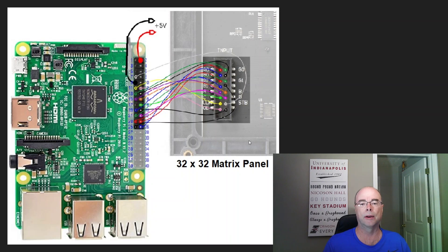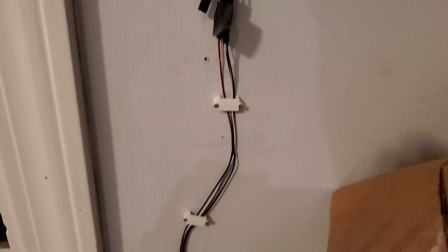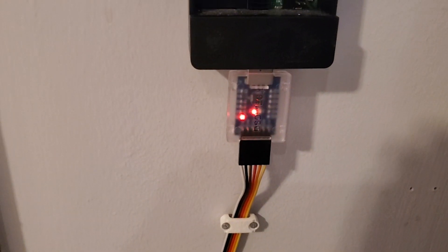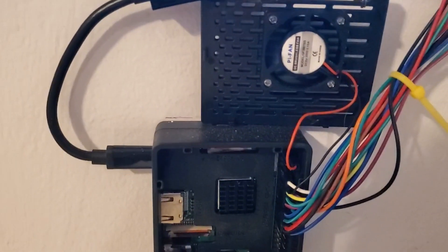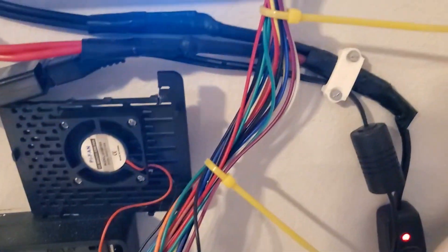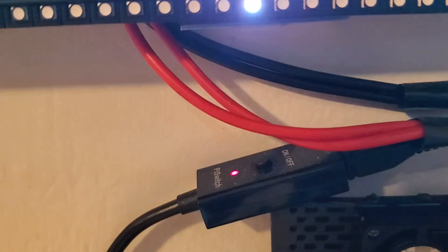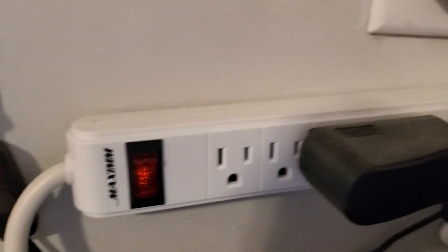Here's a quick look at the wiring between the Raspberry Pi and the matrix panel, and between the TF-mini sensor and the USB TTL. This entire project was completed with no soldering — everything was done with DuPont connectors. I also used the 5-volt output from the Raspberry Pi to power a small fan since the garage gets warm. The power supply wiring runs to a separate 5-volt 3-amp supply for the matrix to avoid ghosting when powered from the same supply as the Pi.